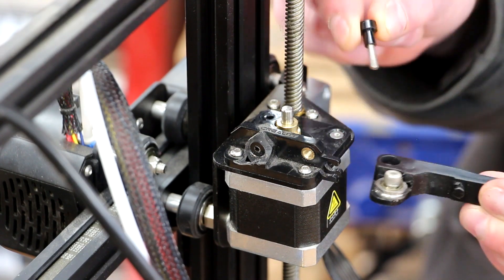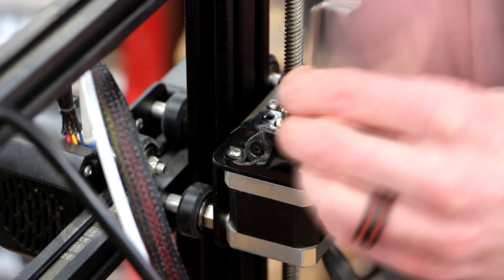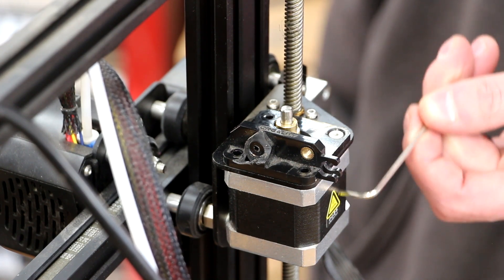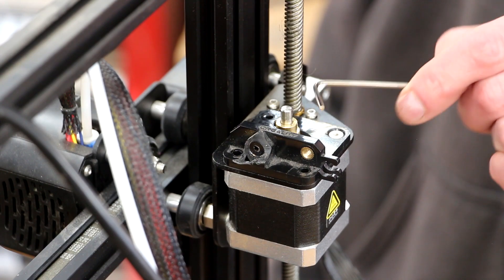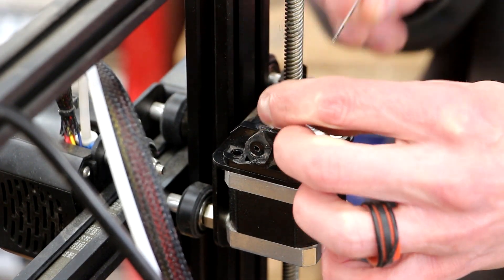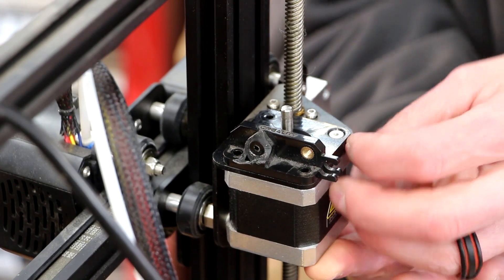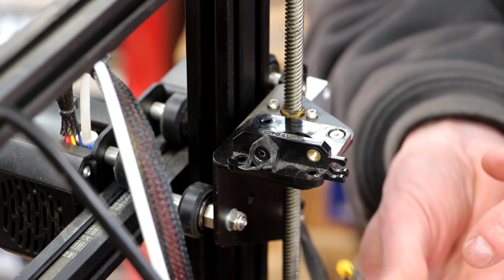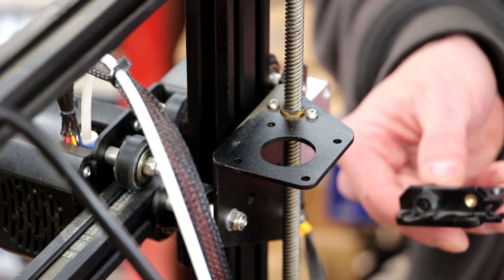This one has the little bushing thing on there. I think all of this is getting replaced anyway, but I want to keep track of where all the parts went. Before I take this last bolt out, which will let the stepper motor drop free, I want to take this gear off of the stepper motor. There are two little set screws we need to remove in order to slip that gear off — you don't have to take them all the way out, but you do need to loosen them. And our gear slips off. I'm going to support the bottom of the stepper motor because I don't want it to drop and crash down. Stepper motor is free — we'll just set that down gently.